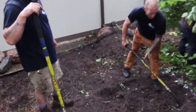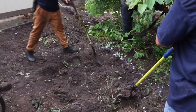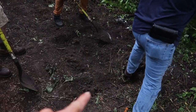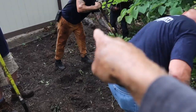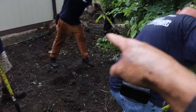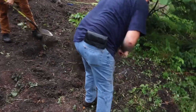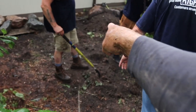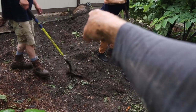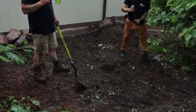We are only about half an hour into the project for the day. We've already got everything ripped out of here and we laid out our reservoir — this is where our six small aqua blocks are going to go. We're throwing all that dirt right up behind Steve. We're going to build ourselves a little bit more of a retaining wall to the right of that as well as to the left, giving us a place to put all that dirt, and then we'll feather that stuff down very nicely and gradually coming underneath this redbud and back over here to the left. The waterfalls will start somewhere back over there, four feet off of the sidewalk — just that one single drop — then a bird-loving stream coming all the way up and through here.